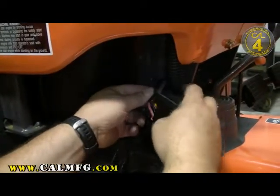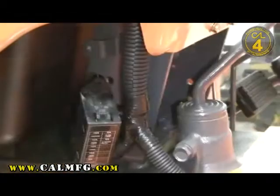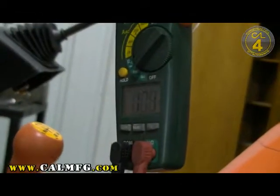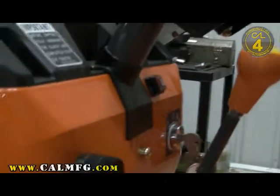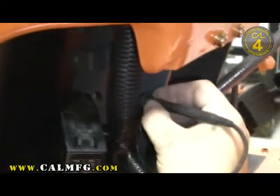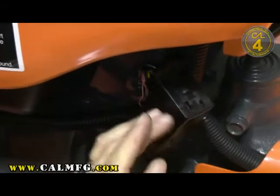On the Kubotas, you can almost always count on using one of the red wires with a white stripe. I've got our meter set up here to read DC volts and the tractor switch is off, just to verify what we have. I'm locating a grounded place — these tractors have a ground lug that you can get a good contact on. You may have to scratch a spot on the tractor chassis, but you want to test a wire using your leads. You can see with the tractor switch off I have no voltage on this line. With the switch on, I'm still on the same wire — on the tractor ground I've got 12 volts, 12.6 volts DC — so this is ideal. We'll use this red wire with the white stripe.